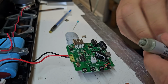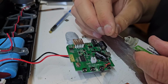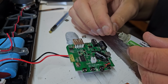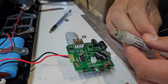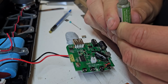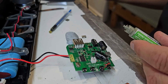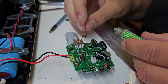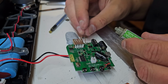Alright, now this solder paste is very easy to use too much of. So I'm going to use just the end of a dressmaker's pin here. We're going to clean out some of the old junk out of here, squeeze a little bit of fresh stuff out behind it, which is easy to do. We're going to put it on the edge of the table here. So we'll take ever so slightly tiny amount of this and dab around here.